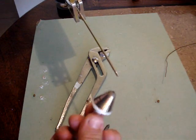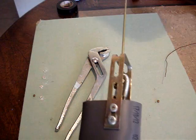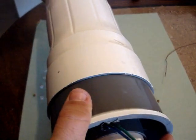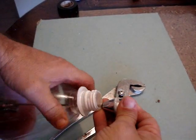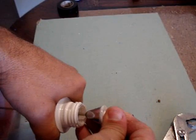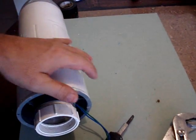The next part is putting on the stopper. I used a piece from a wine stopper that I cut and modified. Another idea would be to use something round — about the size of a ball — to cap the end of whatever container you're using. I used a Coke bottle with a 4-inch coupling on the end that fit perfectly over it. I don't glue this piece so I can remove it if needed. Whatever you use for the stopper, drill a hole slightly smaller than the push rod, then deform the push rod slightly so the stopper fits on super tight.